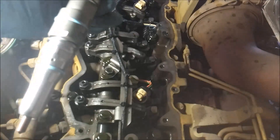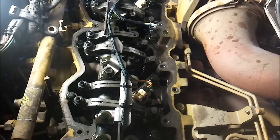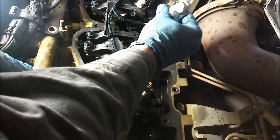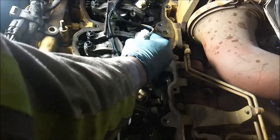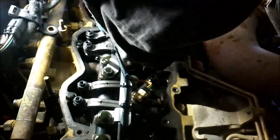CAT also recommends you lubricate the injector bore as well. You could do that with a light damp rag, but I usually just lubricate the injector seals themselves. Next thing you're going to do is take your injector hold down bracket - make sure it's saying C9 facing up if it's a C9, C7 for a C7. Put it in the slot before you put the injector in because a lot of these you can't put it in after you've installed it. Then you're going to slowly lower the injector in - you're not going to let it drop, just place it in, and then push it down a little bit just to seat the first injector seal.